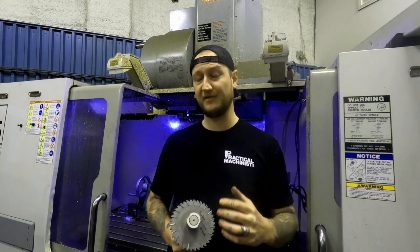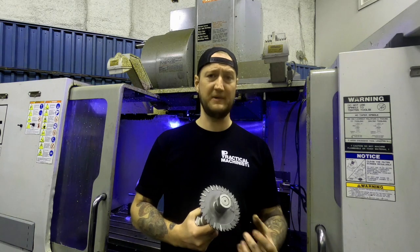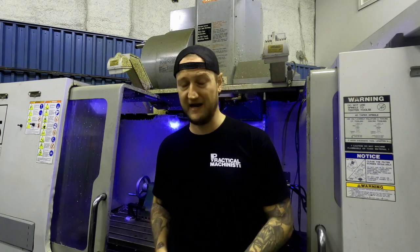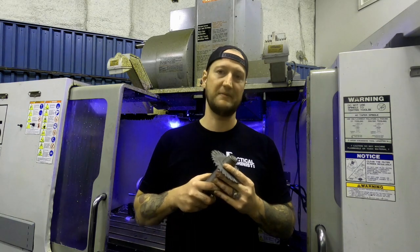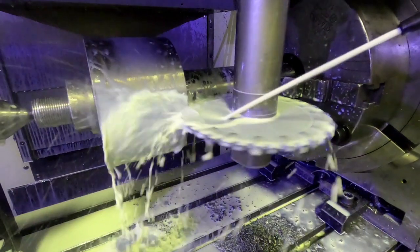When you're dealing with a method of cutting the slots, you could theoretically use something like a 1/8 mill or 3/16 mill that's very long and step it down. The problem you're gonna get into is deflection and chip evacuation. You'd pretty much be doing a full diameter cut. You blow out cutters, and you need to stay on top of making sure things don't wear out. With a slitting saw, you actually get around a lot of that.